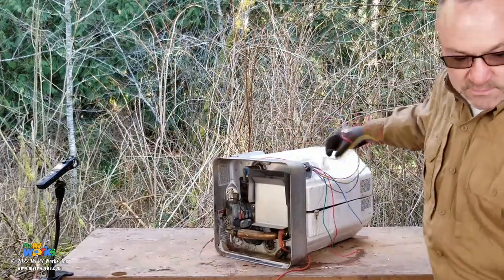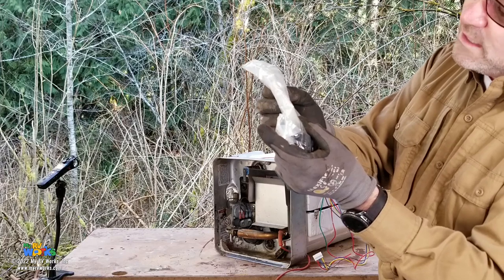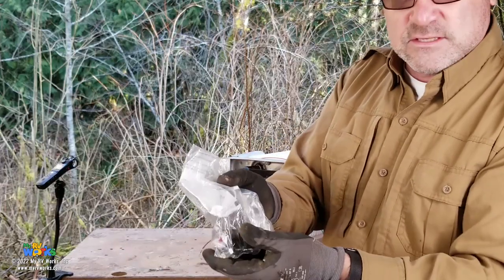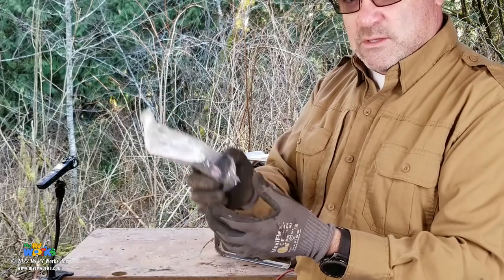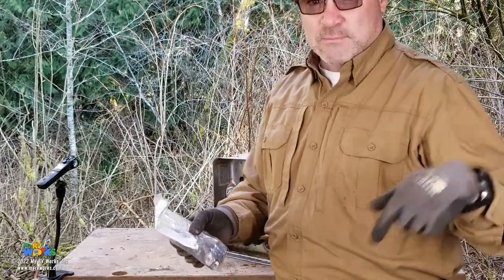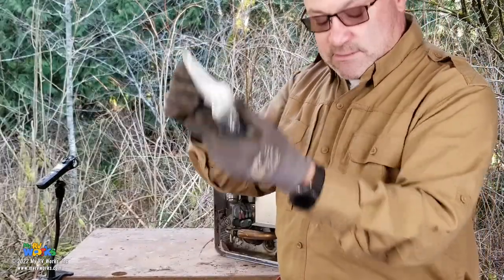This is where those part number sheets come in handy. These are Suburban solenoids, okay? White Rogers 161109. It's got the Suburban part number on it. I've seen these on Amazon. I'll make a link down below. Several people have reached out to us asking where do we get these solenoids from? And so we've got solenoids for the Suburban and also for the Atwood / Dometic. Actually, I might make links to both of those, because if you're watching this video, you might need help on both water heaters. So the brown wires feed these.